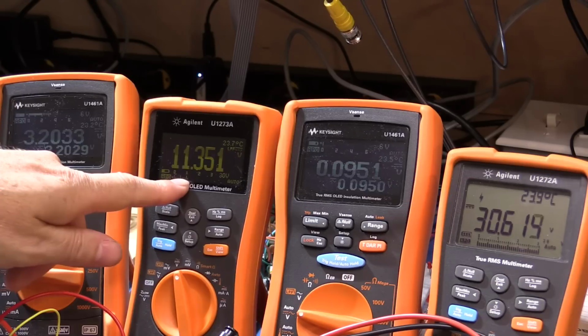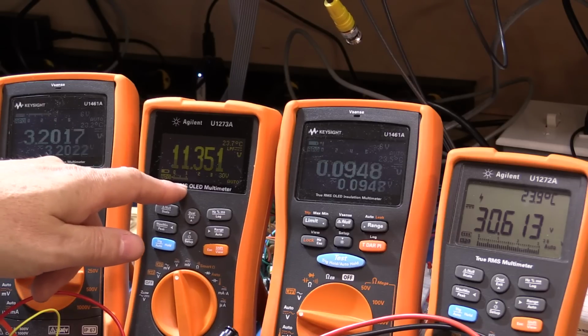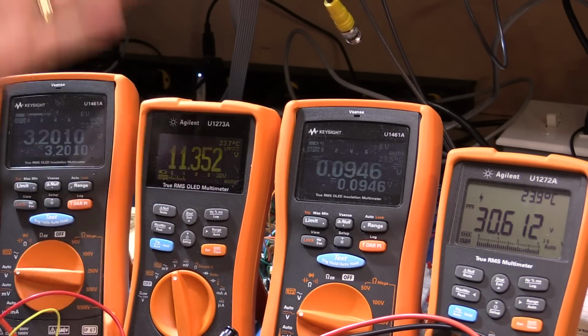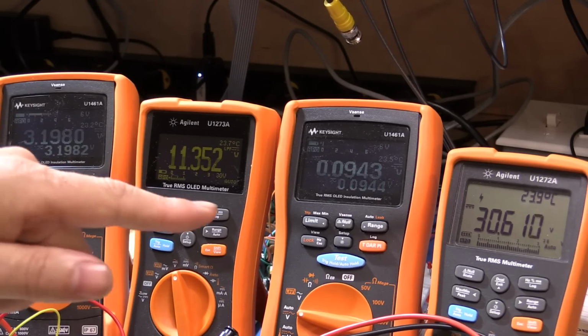So now you can see here that the current one has suddenly decided, oh, I'm not going to be able to get the current anymore because it's basically run out of headroom on the output voltage. And so it's gone high, saying I've got a lot of error. I want to be able to get more, but the diodes are preventing it. And now the differential amplifier and integrator for the voltage side has said, oh, I can control this again, and it's pulled its output down to maintain the output at 30 volts.